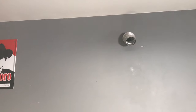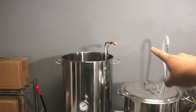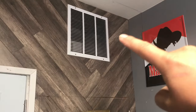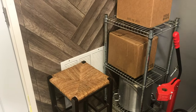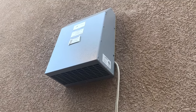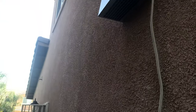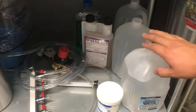I have this vent that still needs to be finished — I plan to run electrical through the back, connecting to the pump, controlled by a switch system I'm going to install. On the other side of this wall is the air conditioning for the wine room, and I have a vent to push out all the hot air so cold air is drawn in at the bottom and pushed out the top — all connected through a manifold system. The smoke fan is 900 cubic feet a minute; I'm going to wire it up permanently but for now it just runs to a plug.